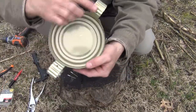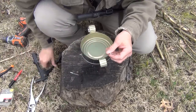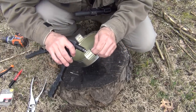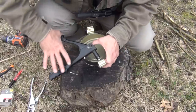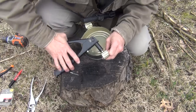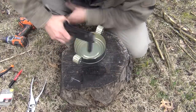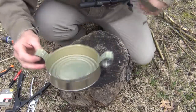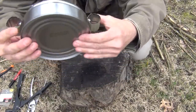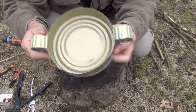Now that we have the holes drilled in both sides, we take our pop rivets and the pop rivet setter, insert it like so, go through both of these holes, holding it very carefully and trying to keep it tight, and squeeze. And there's one, and there we go. So now we have these fastened on, and it looks something like this. You can shape these and make them as round as you wish, but we want them off to the side so that it looks like this.